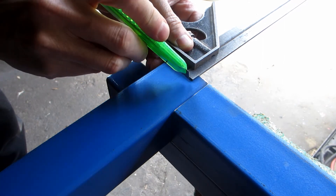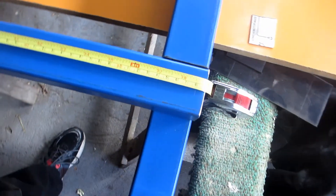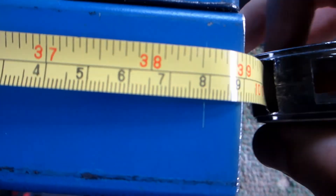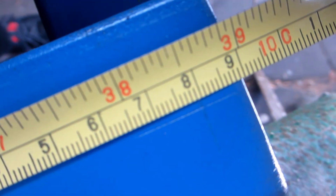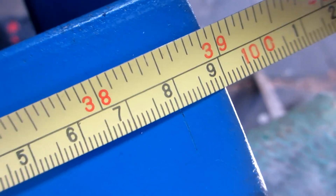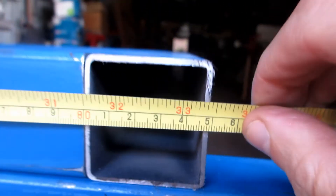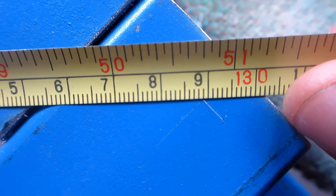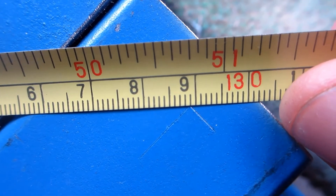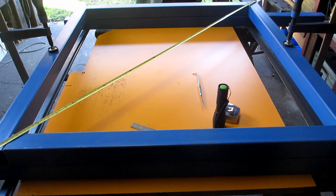I'm using a blade because it makes thinner, more accurate lines to line up your tape measure to. We check the lengths of our guide rails: 979.25mm — and the other side is also 979.25mm. Now we check the width to see how parallel our guide rails are: 848mm on one side, 848.8mm and 848.75mm on the other. Now we check the diagonals: 1289mm on one side, 1289.25mm on the other.